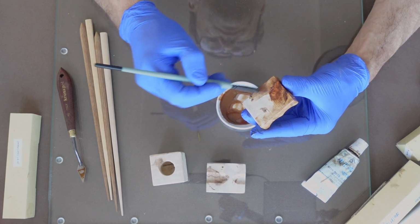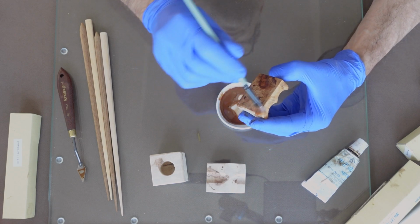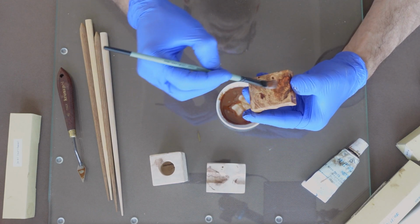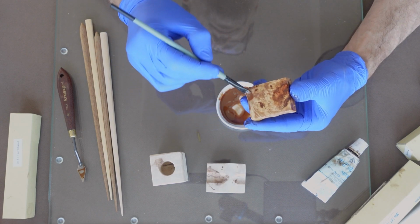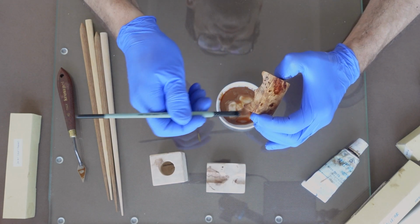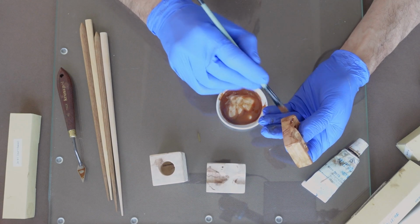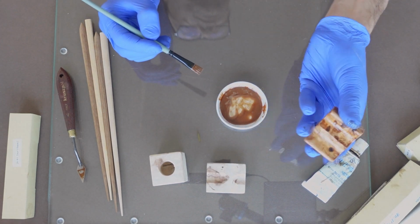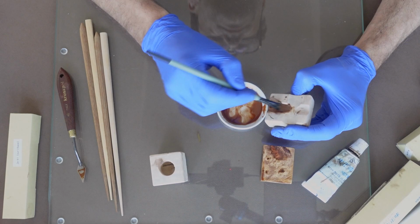The underside, I always try to lacquer the whole object, because wood is alive. Wood works and it sucks the humidity from the air and expands and contracts. So you want to seal the whole object, so as not to let those changes in wood wetness and humidity happen. Okay, so first layer. I will leave this piece for a while and then we'll reapply the urushi. And the second holder.